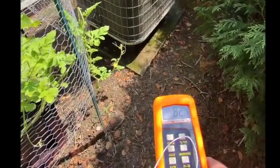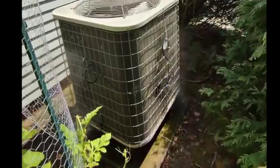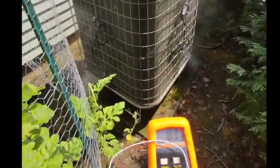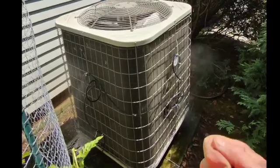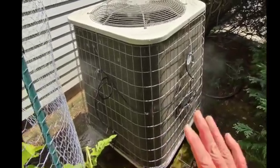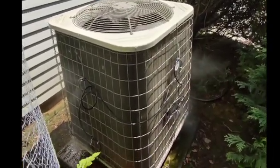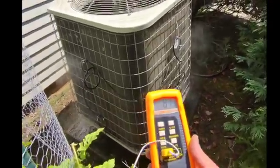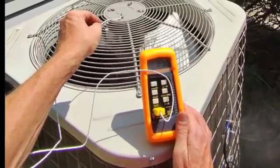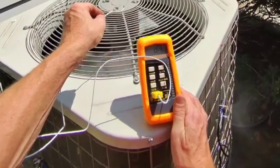By the way, if any of you are wondering why I'm not using an infrared thermometer — those don't measure air temperature, they just measure surface temperature. People who are pointing a laser-type device at a surface or even at air with a surface behind it are really getting the temperature of the surface behind it. So I've seen some people use those to measure the output temperature at a register, and they're not necessarily getting the temperature of the air coming out — they're getting the temperature of the metal on the register. That's why I use this. Currently it's about 81–82 degrees out here in the sun. Let's test the temperature of air coming out the top — we'll call it 85 and a half.